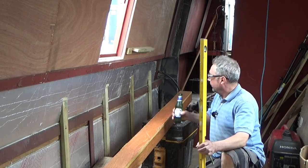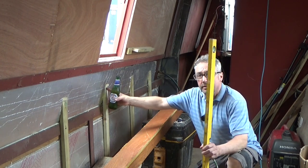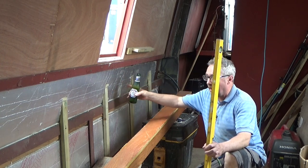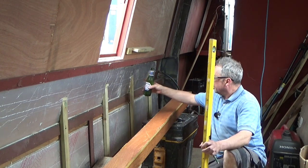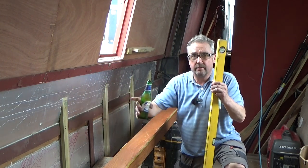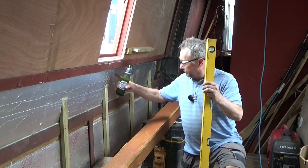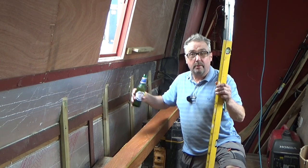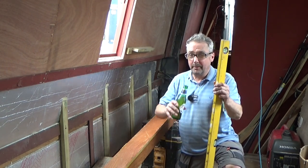That's dried up, so I'll try setting it out under here now. We'll trim the top of these off, about 20mm off of them, so it'll sit along this line. Scribe along there, chop the insulation off where required, a straight line all the way across, and that'll rest on them. And then I'm going to try and screw it to these gunnels. So anyway, we're making it up as we go along, but it'll work, don't worry. Cheers, by the way. I'm ready for one beer.